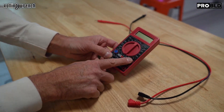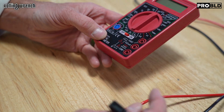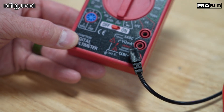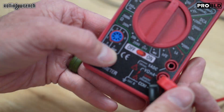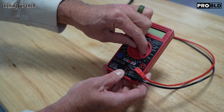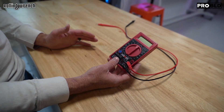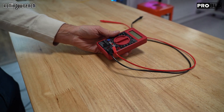When you get this sucker out of the box, most of the time you're going to have three ports, and you'll have a black wire and a red wire. The black is always going to be ground or common — plug that into the COM port. The red wire is just going to go into the VMA port. To be honest, there's a lot of stuff on here I've never even used. I'm going to show you the basic stuff for diagnosing electrical issues — I've been doing this for about 25 years, and you don't need to know how to use all of it.